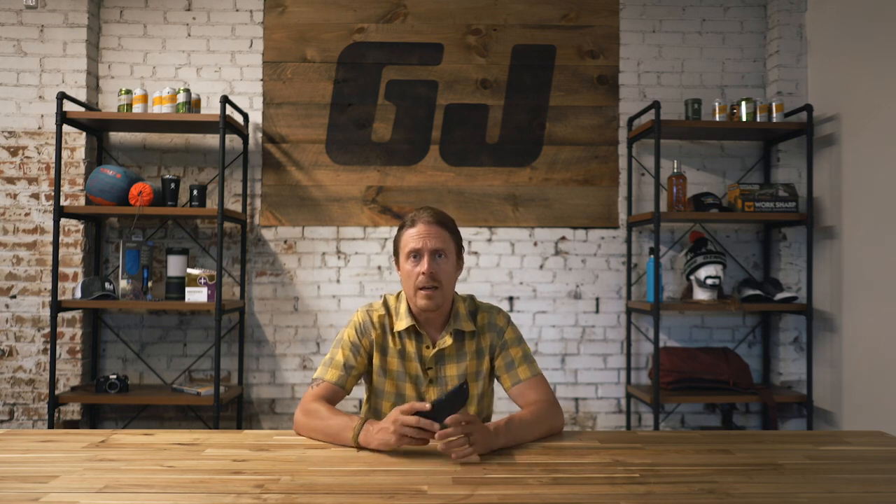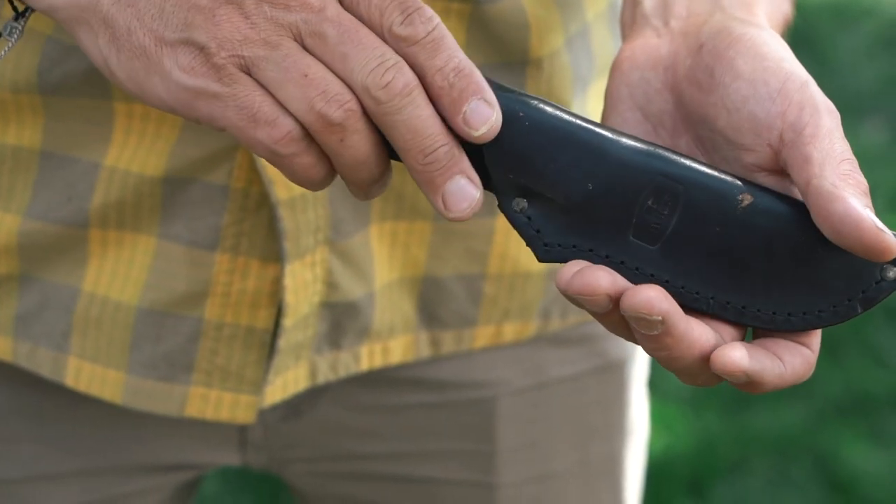The first thing we're going to talk about is the knife steel. The steel is the working part of a knife — it's what gets the job done and what differentiates a lot of knives from one another. This knife is made with S30V steel, which is popular across the market in medium to higher end knives for very good edge retention and toughness. I have personally skinned and cleaned an entire elk with this knife without resharpening it. The type of steel is going to be one of the biggest factors determining price — higher end knives will have more expensive, better performing steel, while cheap gas station knives will have much worse steel. If you want to geek out about knife steel, we've written an extensive article about it — you can find the link down in the description.